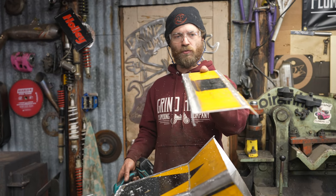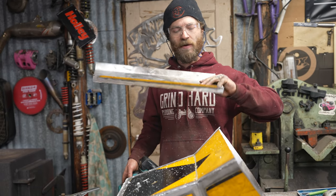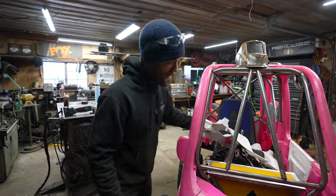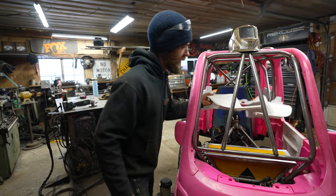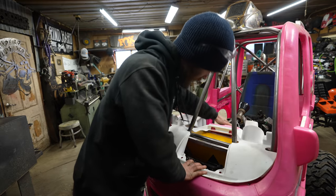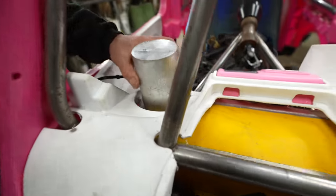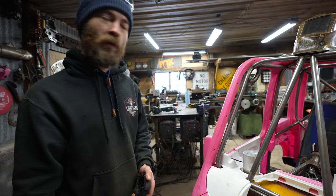You know what this is? Weight reduction. Not only will I lose a few grams of weight from this being a flatter piece, but I'll also lose a few ounces from having less gasoline. Win-win! Gas tank take two — got the top all chopped down and re-welded all the way around. Now the dash actually fits. There are still a couple little things I need to trim on the underside, but basically it fits. Gas tank is ready to go. Now I'm going to turn this chunk of solid aluminum into a bung with threads on it for the old gas cap — onward to the lathe.